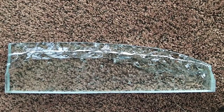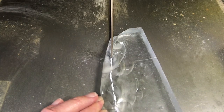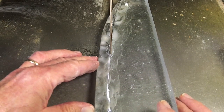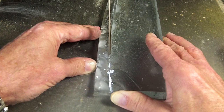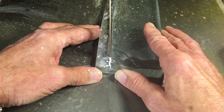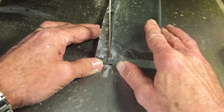After the initial faceting is completed, the lower half of the pattern is traced onto the glass. The faceted piece of glass is now cut away from the glass strip using the 10-inch water-cooled ring saw, which is more appropriate for this task than the tile saw, since the lower edge of the pattern is an inside curve. It is important to start the cut at the narrowest part of the piece since it is the most fragile. If the saw cut is initiated at the widest end, the glass has a tendency to fracture when the saw blade reaches the narrow portion, since it is now only attached to the underlying glass by a very thin and fragile bridge.